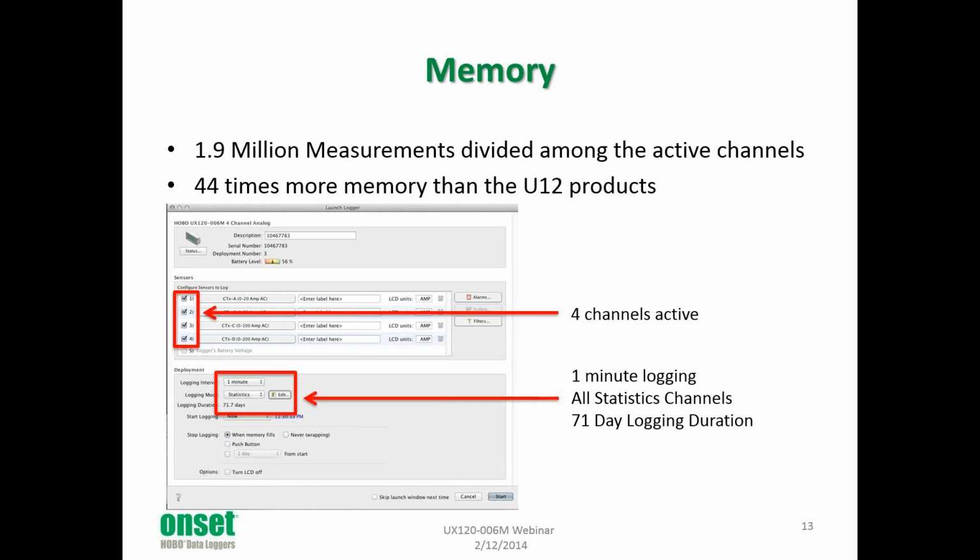One question came up on the measurements: do we have a sensor for humidity for this product? We actually don't. The sensors that we have right now are combined temperature and humidity sensors, and they don't connect to this particular interface. In the past we have recommended the Vaisala temperature and humidity probes, which are a combination sensor with two analog outputs, one for temperature and one for relative humidity. That's something you can talk to our sales staff about, and they can point you in the right direction.